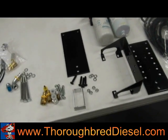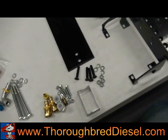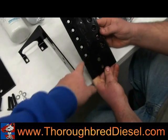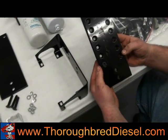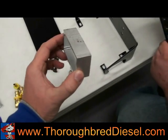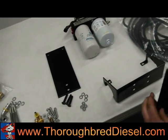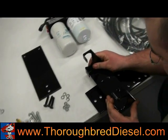The first thing you do during the installation process is sort out the bolts. You'll have four hex head bolts and four nuts and split washers. Take this mounting bracket — this is what the pump mounts to — and this is the back plate that mounts it to the frame. The back plate is indented here so the bolt sets down flush. We use the bottom four holes on most applications, but it's drilled so you can set the pump height higher if needed. There's also a spacer that goes in between the bracket and the mounting bracket for the pump.